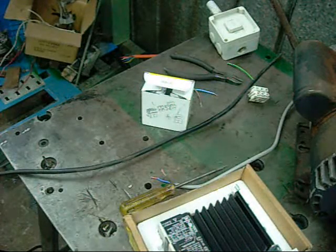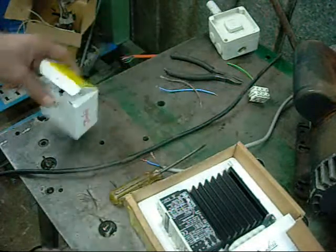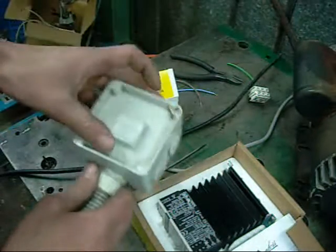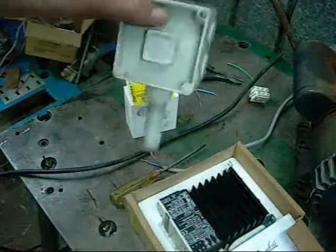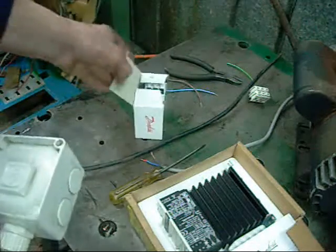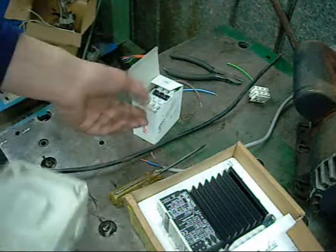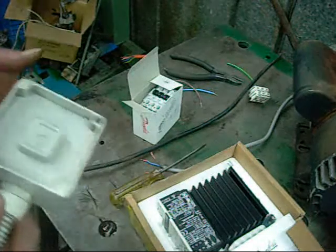Okay, now it's time to put this little jigsaw puzzle together — starting torque limiter and contactor. I'm not going to use the main manual switch. You can substitute a contactor for one of these and just run straight to the torque limiter and to the motor. It's basically the same setup, except with the contactor you need a normally open and normally closed switch to energize and de-energize the coil — start and stop buttons as momentary push buttons, which is quite cool for a piece of machinery.